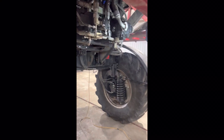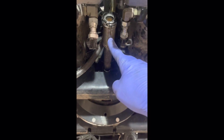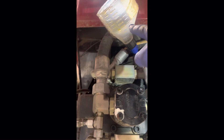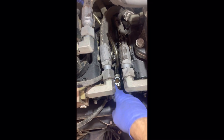Just wrapped up here. Put that eight-inch nipple with the T, then put the sight glass in on the end of it, and run my filler. This works really good because on the bottom you can regulate how fast the oil goes in — you can't dump it in otherwise it'll spill, since it's gear oil and it's got to run into the gear case. So at least you can regulate it.